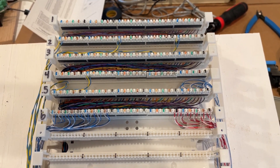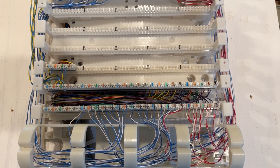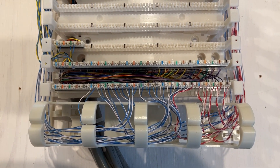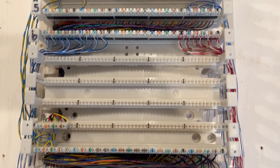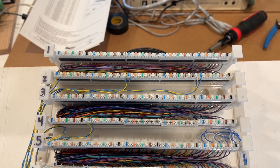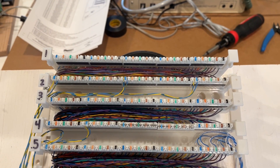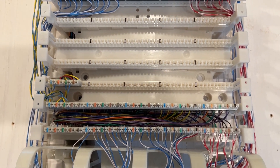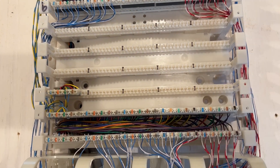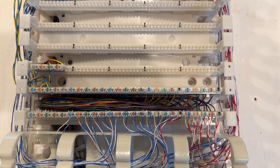We've run a handful of cross-connects on this block just for illustration, and of course they will be left here. The white and red wire on the right side is for power. The white and blue cross-connects down at the bottom are connected up to the trunks. The yellow and blue, which is your typical Bell System cross-connect for one pair of circuits, are connected to some of what would be the jacks. The jacks will be randomly connected, and down here towards the bottom on the tie cable — one to 25 and then 26 through 50 — those will go to the mainframe and connect to phones or a key system and other things.